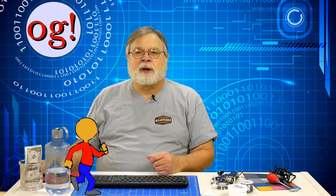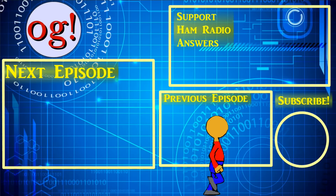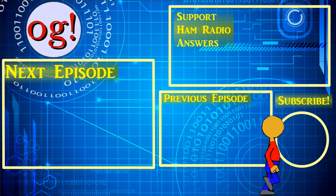In summary, the biggest breakthrough for me was putting some flux on the desoldering braid. What a difference that simple flux makes — that was enough for me to complete my little QRP Labs QCX QRP rig. Many thanks to the several viewers who responded with tips about unsoldering simply and safely. I hope I trigger the imagination of kit builders who are faced with the task of correcting a mistake or inserting a modification. Until we next meet, 73. Next Wednesday I'll review the QRP Labs QCX 5W single band QRP rig. Please subscribe and check out the support page.